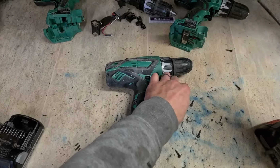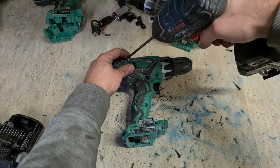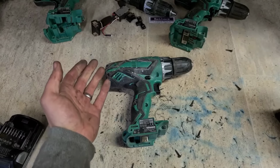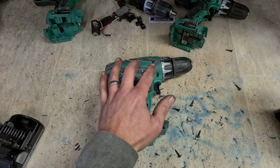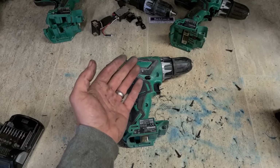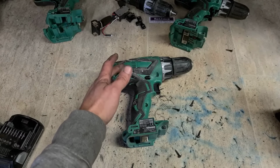You can dismantle the motor if you want and try to fit new brushes to it. You can do it with a lot of difficulty, but it's hardly worth it, to be honest. When the DC motors actually run through the brushes, that brass brush holder generally starts touching the armature and shorts it out a wee bit too. So when they wear through the brushes completely, the motor is generally worn out anyway.